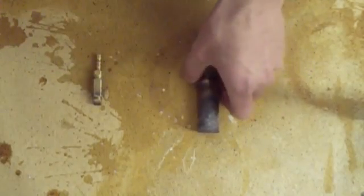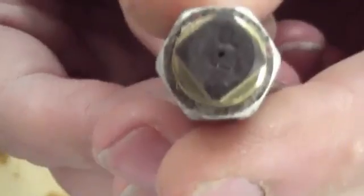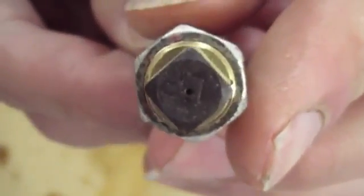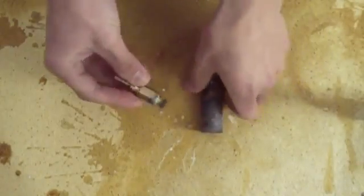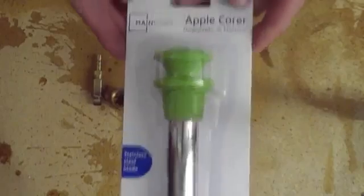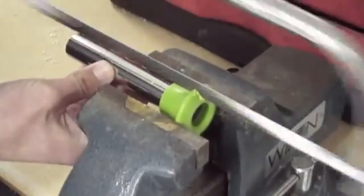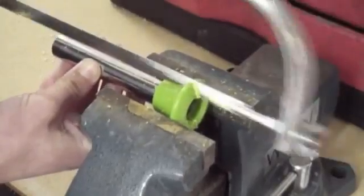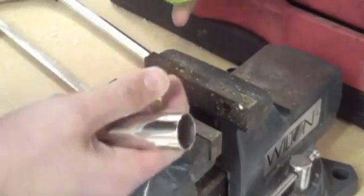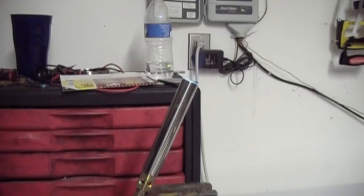I plan on updating this design slightly. Here you can see the orifice, which is a 1/8 MPT plug with a hole drilled in it, a 1/8 coupler, and a 1/8 hose barb — it simply screws onto the back of this assembly. The stainless steel tube is actually an apple coring tool I got for about $4. After cutting off the plastic piece you are left with a nice large stainless steel tube. Here it is assembled with the longer, newer tube and it burns much better.